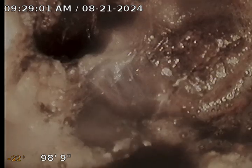As you can see, here's some more PVC in the yard here. So the sewer does have multiple areas with repairs. You can see here it appears we have a bit of a shift as we drop back down. Again, the sewer does go out the back of the house. Appears that we can't get past this root infiltration. Oh, there we were able to slide through. Again, we didn't have much of a visual.